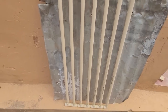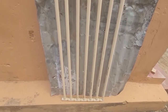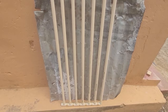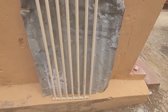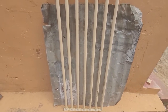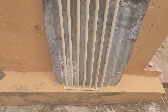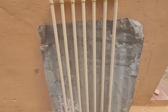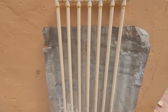Now, if you want to increase the temperature and the efficiency of your little solar water heater, you would get a sheet of glass and put it on top. You would try to make the entire thing as airtight as possible — so any little holes existing in your wooden box, you would fill with silicone to prevent air from coming out.